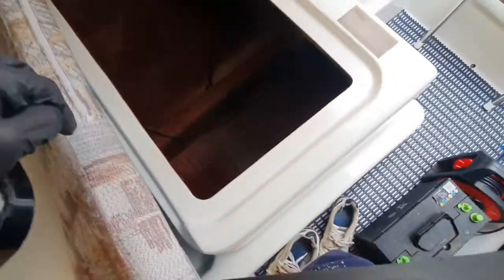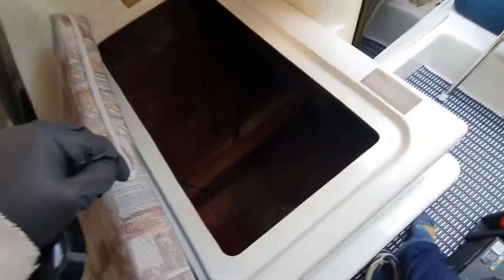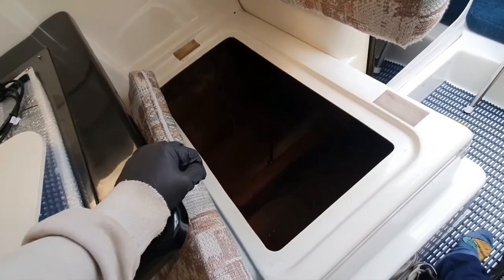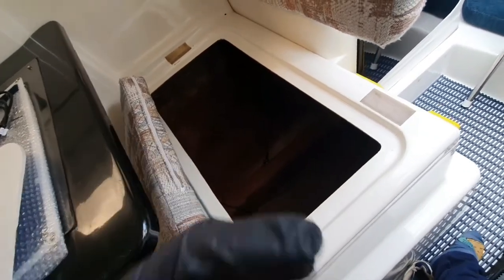I've been trying, ideally, I just wanted to go straight across there because I'm going to put the bilge pump in there. These are difficult boats to put bilge pumps in. A lot of people say you don't really need them, but that is the lowest point that I can find, and I'm putting the bilge pump in because I just like that little bit of extra reassurance for an emergency. I know these things float, they fill up, but I really don't want it to fill up, especially if I'm not with it. So it'll just give me a bit of peace of mind.